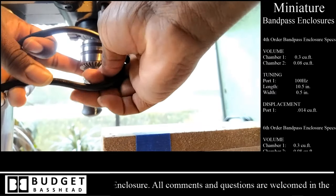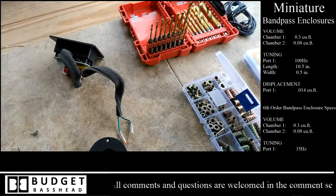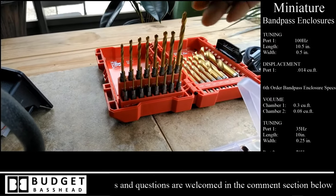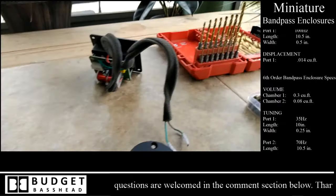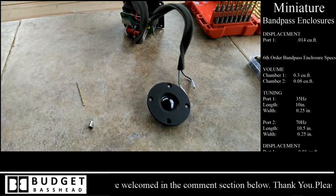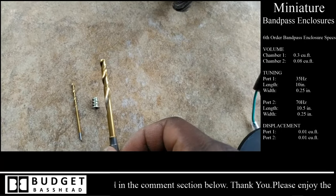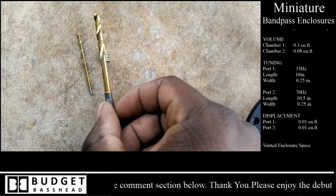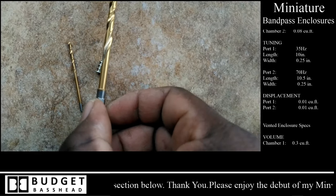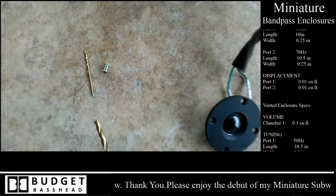This is me chucking the little guy out. And I'm going to have to put the big guy in. It's all about selection. Right now, what I'm trying to do is just size the correct drill bit for the wood insert. You want one that's slightly smaller than the wood insert. And this is what I came up with, is this guy right here. And as you guys see, once I place it over top, the only thing you see sticking out is the threads, and that's what you want. You only want the threads sticking out. You want the body of it to actually go inside.